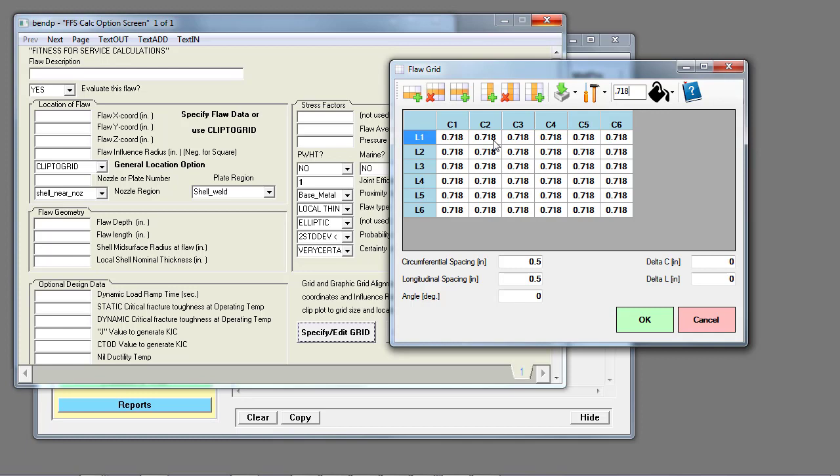You want to make sure your thickness field is sufficient to get to the nominal pipe. Often you've got over-specified thickness — very few vendors will manufacture to such tight tolerance. If you use the minimum thickness, you wind up having some thicknesses greater than the nominal, and if you assume nominal or minimum everywhere else you'll have locally thickened elements. Make sure you have enough coverage that you're ensured to be away from the measurement profile. I start filling out my grid from my measurements.